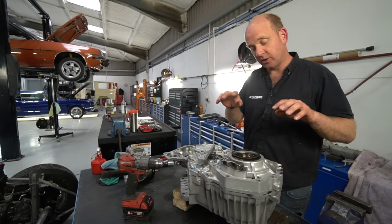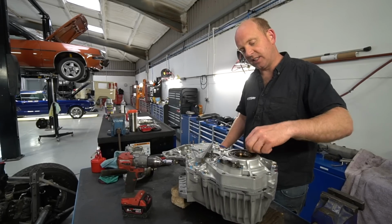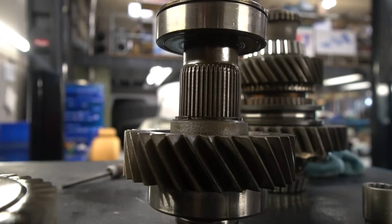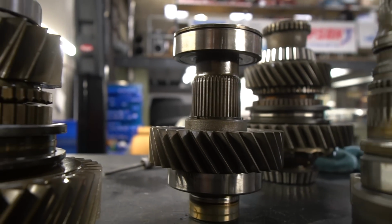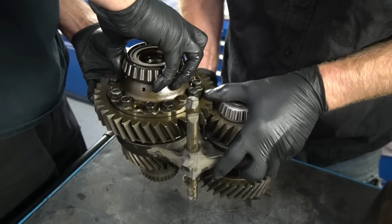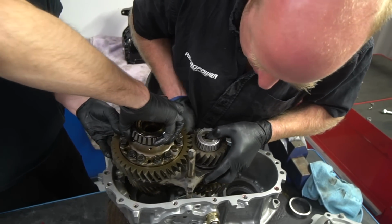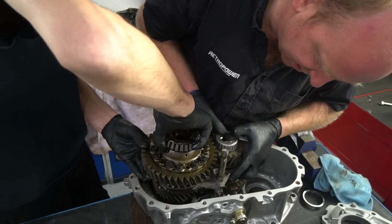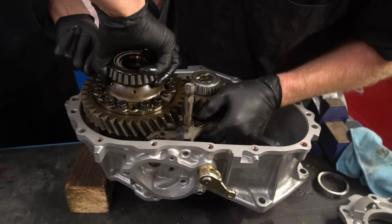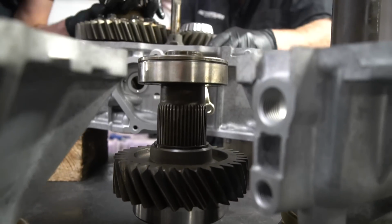Interestingly, when I got to the stage of putting this back together, I've discovered that the biggest bearings in the gearbox, which are the output shaft, which is also the centre differential, don't have any preload. Now the box did have sealer around the split line on it, so it has been apart. And there are normally, as they come from Toyota, apparently, according to the internet, generally 2 shims in here, and there is only 1. I suspect that somebody dropped one of them and didn't put it back in when they had the gearbox apart. I suspect it also hasn't been used much since, because the bearings are all, as far as I can determine, in extremely good condition. There's no marks on any of the bearings, it all looks great.